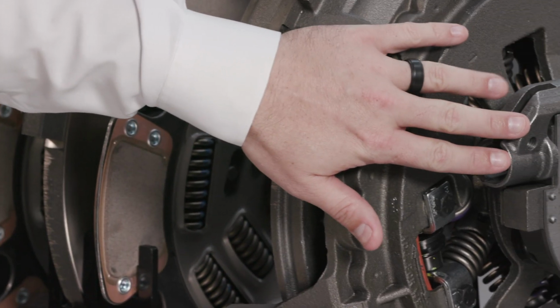Keep in mind that the maximum brake squeeze in a truck cab should not exceed 1 inch from the end of the pedal stroke. If it does, here's how to adjust it. Change the pedal stops in the cab to reduce the total pedal stroke. Increase the 1/8 inch fork to bearing setting to lower squeeze. Doing this will increase the free pedal travel.